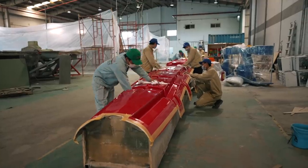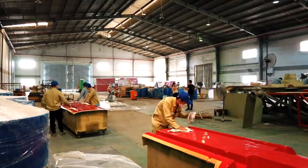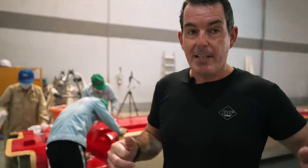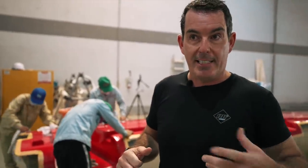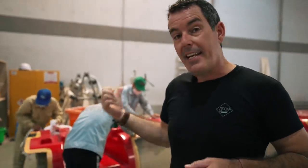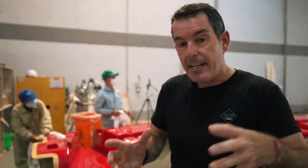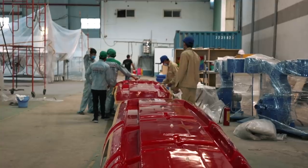These guys are putting down a wax layer. They put down wax because it stops anything from sticking to the mold. What happens is they put wax in, then spray gel coat in and let it set, then take all the gel coat out again. Why? Because if they've missed a bit, the gel coat will stick to the mold and they can easily identify it. Shane, James, Mike, and Danny have all said: if you skip this step, you end up with a higher chance of getting the gel coat in, then the fiberglass down, and then finding everything won't release from the mold.